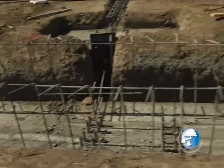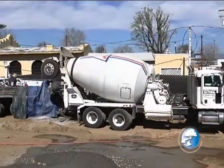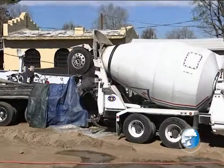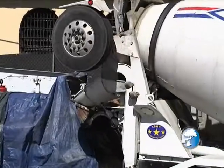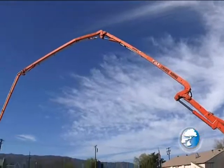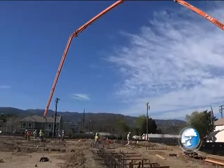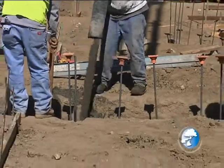Here yesterday it was really impressive to see just concrete truck after concrete truck pulling up. Can you give us an idea of how much concrete is involved in yesterday's pour? I didn't get the final count. We'd estimated some 400 cubic yards — I think it was maybe 450. There were 35, 40 trucks. They started at 6 in the morning. They had a pumper that we were able to set up in one location and pumped all locations of the building. They had the concrete poured out prior to noon, so it went very smooth.